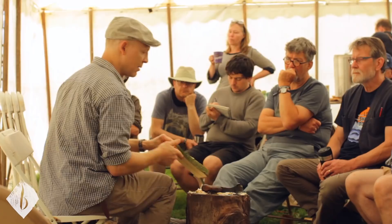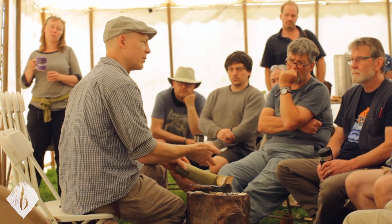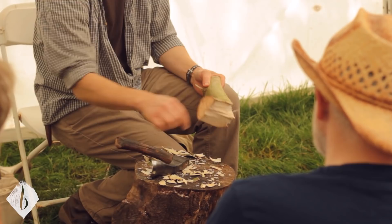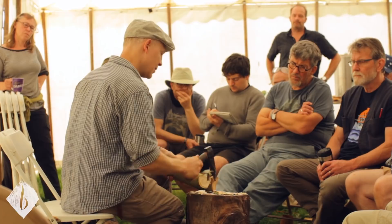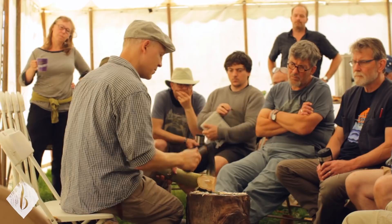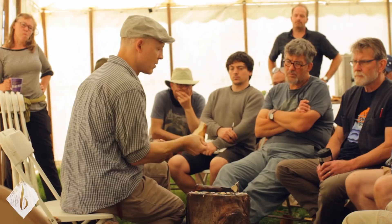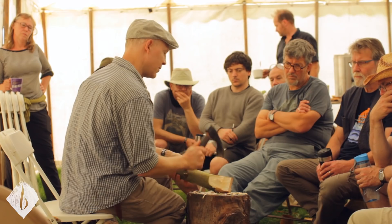Before I work on the outside, I can narrow this down with the axe and get under the handle. This is an easy cut with the axe on the outside. So I'll keep working on this crook and take it to a roughed-out stage to show you how I would keep rolling with this. I want to get down to leave the thinness of the front edge here — it just keeps getting a little bit thinner.